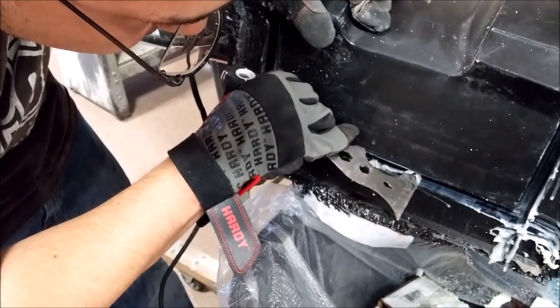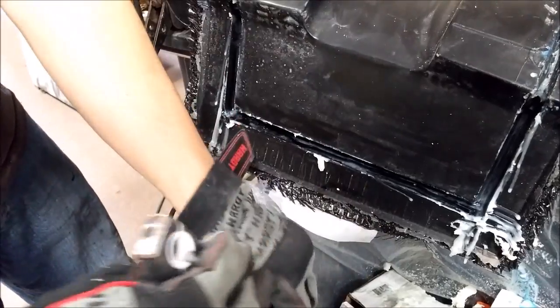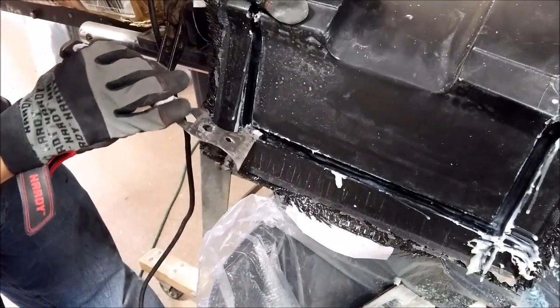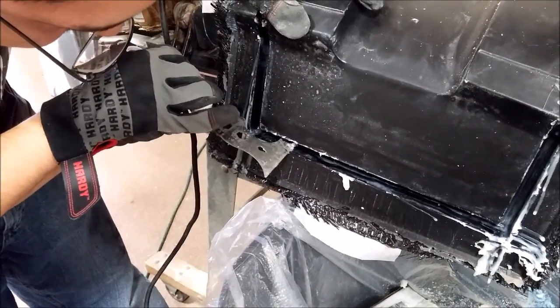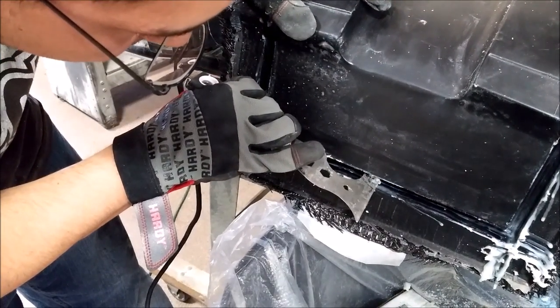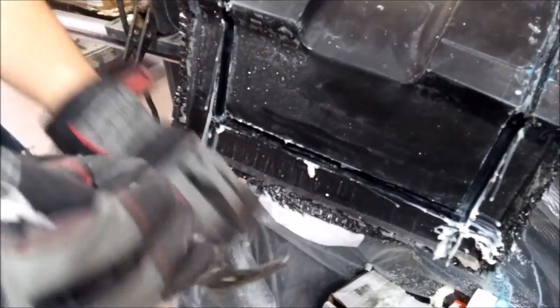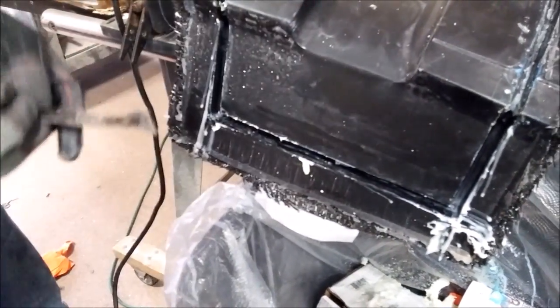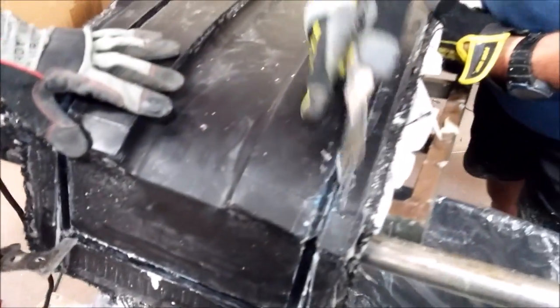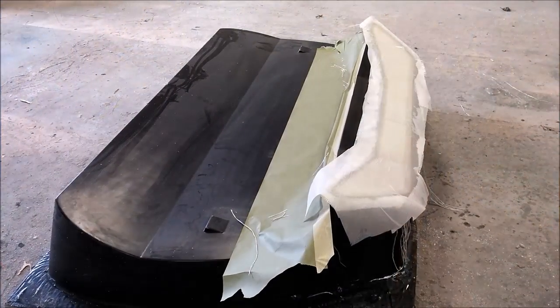Here are the guys cleaning the wax profile out of the channels on the floor braces. Those channels are so that when we create the actual part, we can put a latex seal around there — it'll run into those channels and create a good vacuum seal. We can then reuse that latex seal instead of having to put a plastic bag on there every time for vacuuming.